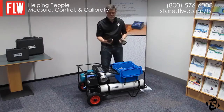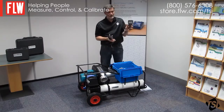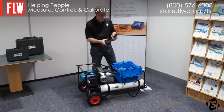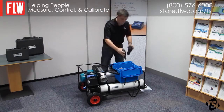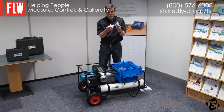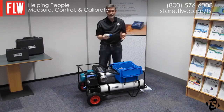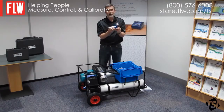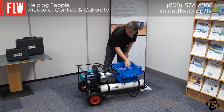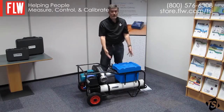Two instruments: this is your TA465P and this is the PDM610. This is for measuring the leakage rate and this is to set up the static pressure. When they arrive they come in their own cases. You can use the cases if you like, or there are positions available in the box to protect them. Lastly, we have a 230 volt mains supply adapter. You can also get a 110 volt version but that's a separate Panda with a yellow socket — you can only use the 230 or the 110. And it must be wired up by a qualified electrician. And that's the contents of your instrument box.